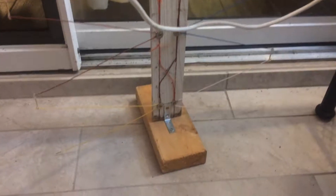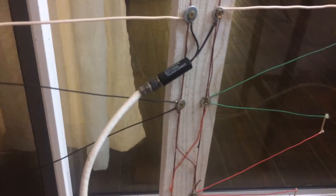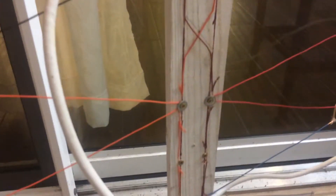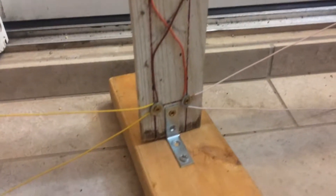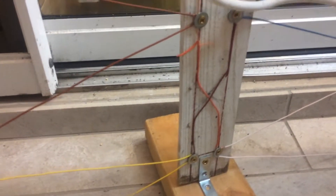This is a four-bay antenna that I built based on YouTube videos. I used very thin wire — it's the only thing I had — but it seems to be working very well. You can see the four bays: one, two, three, and four. I used the typical crisscross pattern I found online, where they crisscross on the top and on the bottom.